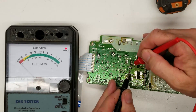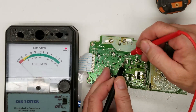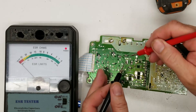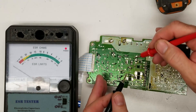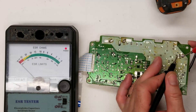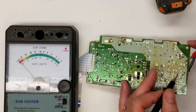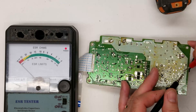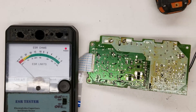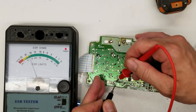470 — zero, good. 10 microfarad — I expect maybe two ohms, just under three — that's okay. 470 — good. Over here we've got a 220, this is the main AC input filter cap — about a quarter ohm, good. 10 microfarad — two to three ohms, I'm okay. Four ohms — that's the snubber capacitor, mainly only used in startup. These 220s are very suspect to me.